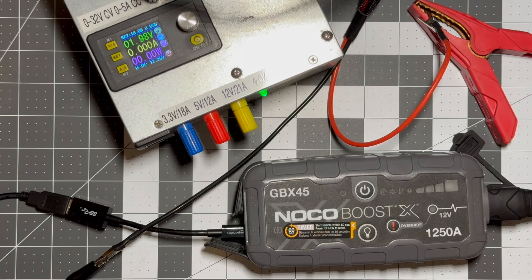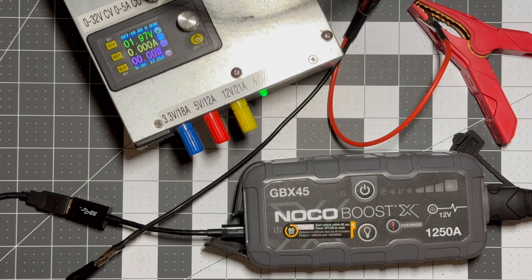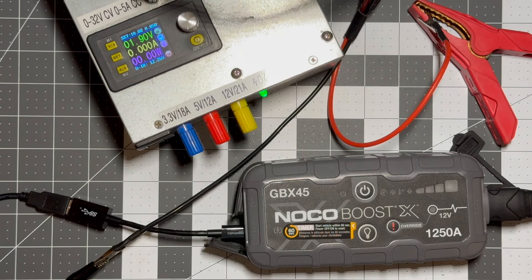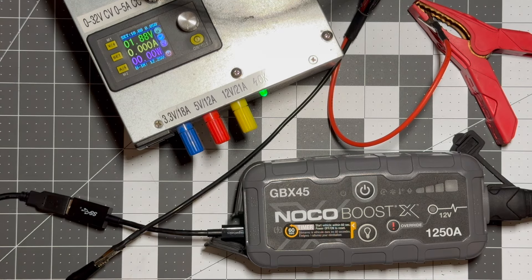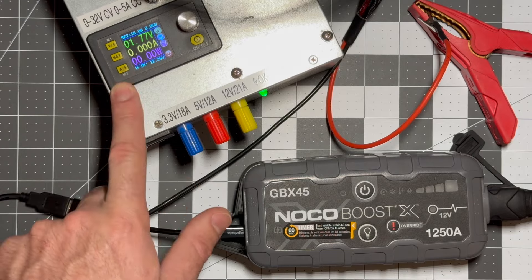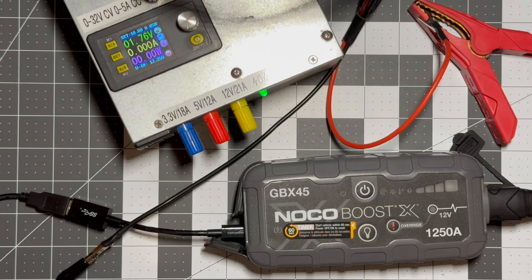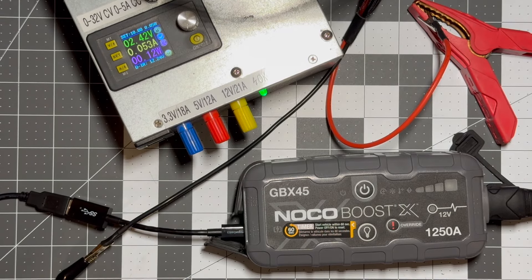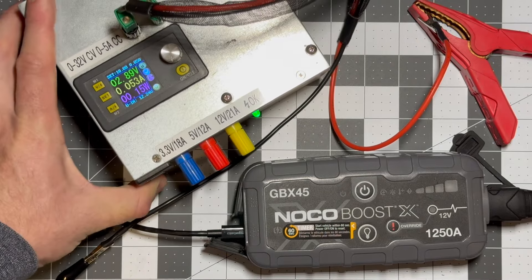As was done in previous videos, what I'm going to try to do is feed just a little bit of power into that battery inside. I don't want to give it a lot of current for two reasons. One, a really dead battery shouldn't be charged with very much current because it can damage the cells. Or if the cells are bad, you would rather find that out by seeing that the voltage isn't rising rather than give it a lot of current and possibly create an overheating situation or something more dangerous. Right now I've got the power supply set to 50 milliamps and voltage limited to 10 volts. So let's go ahead and turn that on and see if we get any reaction.